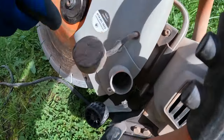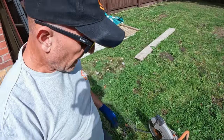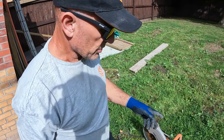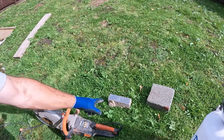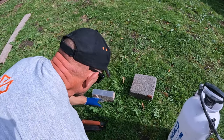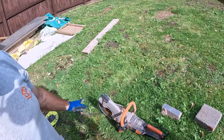There's also dust extraction — you attach that there if you want. We've used it wet and we've used it dry. Alex is going to give you a quick demo with the water suppression on to show you how it cuts. We're going to cut a fibre-lite block, 100mm, and a solid blue engineering brick which is 112mm deep, to show you the depth and how fast the cut is — it's a really, really good fast blade.